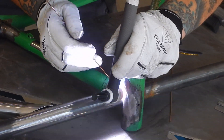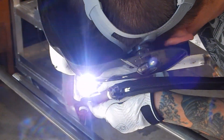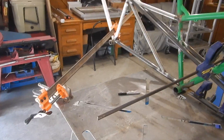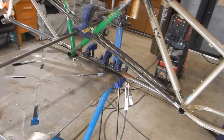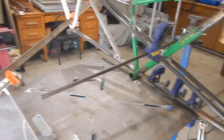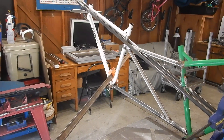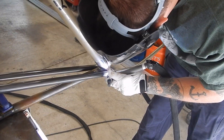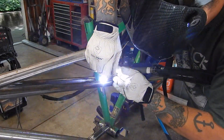With all the fitting done and the new chain roller built, it's time to get over to the welder and get all the tubes tacked in place and then welded up. We know the frame was a little bent, so we clamped it to the table and used a long clamp to spring it back to straight. Now we're going to tack these truss rods in place and weld it all up. Once all the tubes were tacked in place, we went back and welded all the joints.